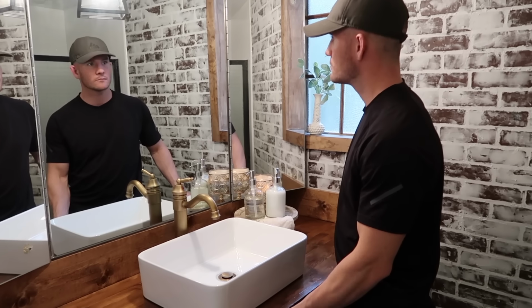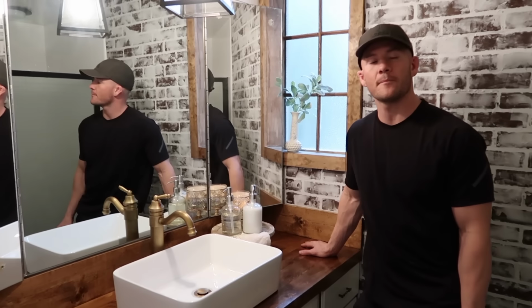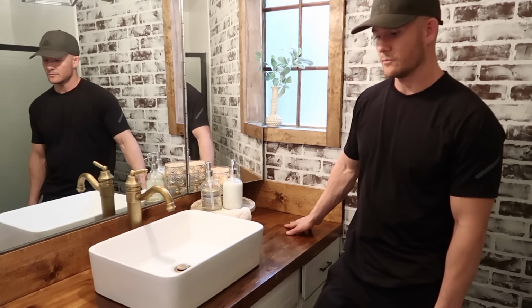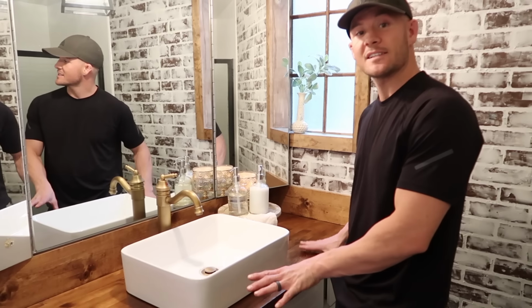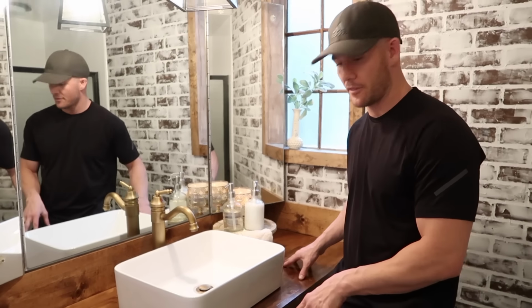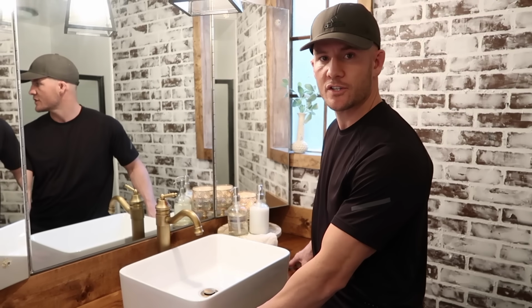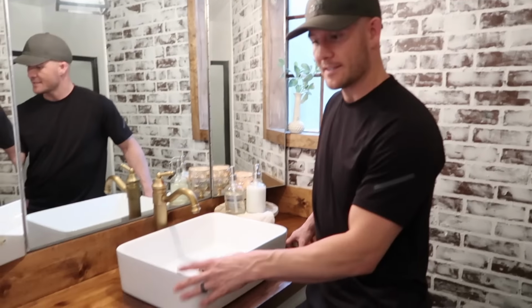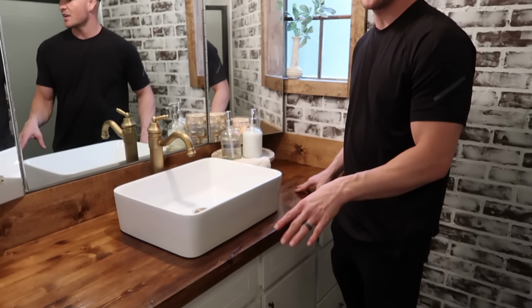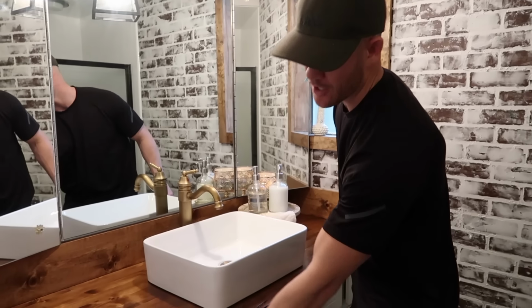I was out doing the tramp when you did this countertop. So kind of explain the whole process of if somebody is doing a countertop in their bathroom or kitchen, what they would do. So if you're gonna leave the existing vanity and the existing countertop, I always suggest leave the countertop that's there, put the piece of wood over the top of it. You don't need to rip that top off if you're gonna do just a thin layer. Like this wood I think is 3/4 of an inch thick. It's really thin, right? It's still thin, so it's not this thick that he made the lip, right? It just makes it a lot easier to do your cuts. If you rip that out, then you have to worry about securing it into the wall on both sides, like where the vanity stops, like this for example.